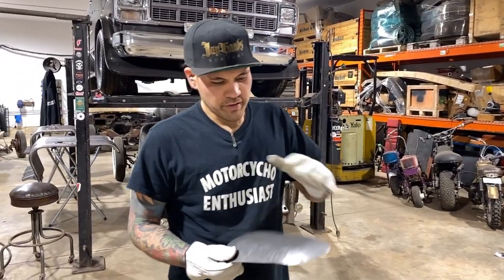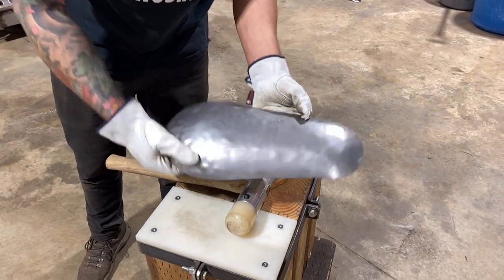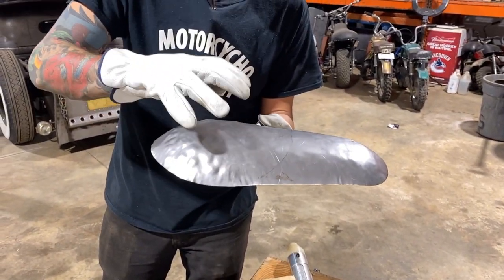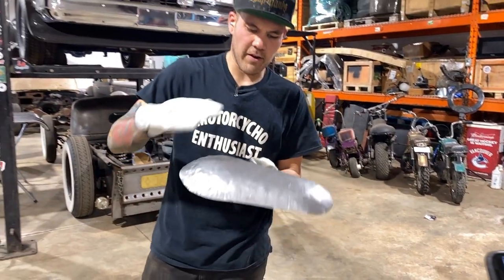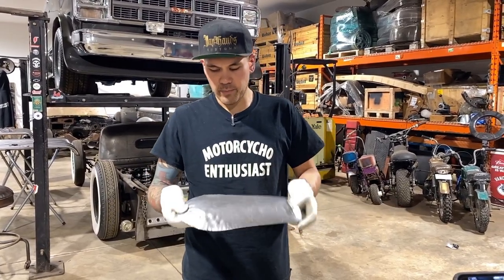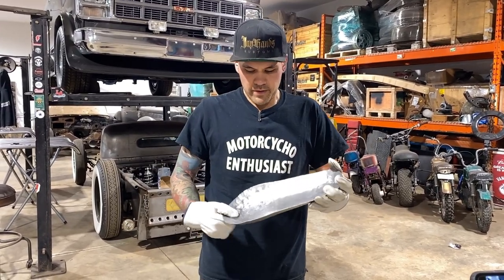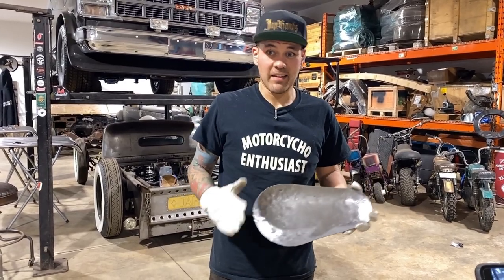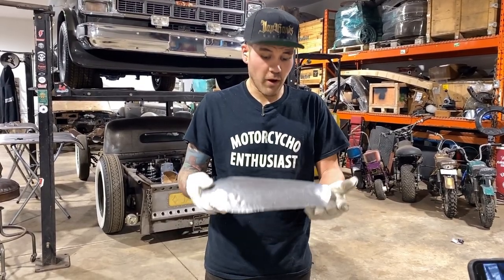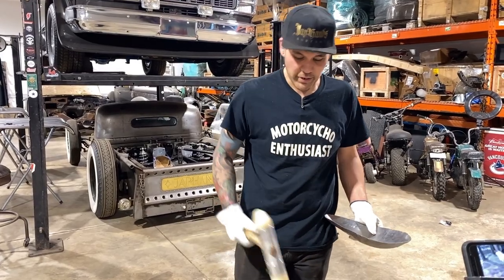Now I'm just smoothing this all out, hitting it with the nylon to knock out all the imperfections. I'm laying it flat on here to make sure this plane is straight — this was a little overdeveloped, so I'm running over the whole thing. It's kind of like planishing: you're just trying to smooth it all out, make it all onto one even plane, taking out all those little dimples the hammer is leaving and getting it closer to its final shape. Then we'll go to steel and one of the polished hammers. Already, an incredible amount of shape can be put into a panel with just a hammer and a shrinking stump like this.